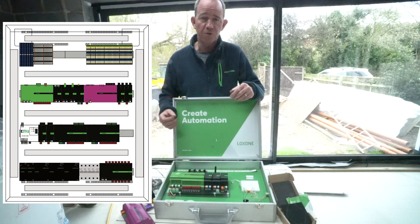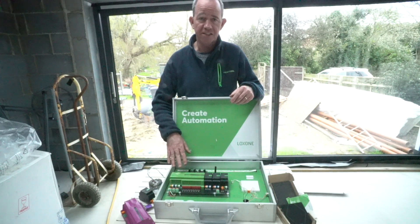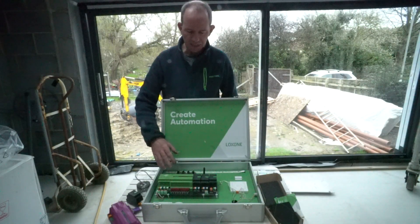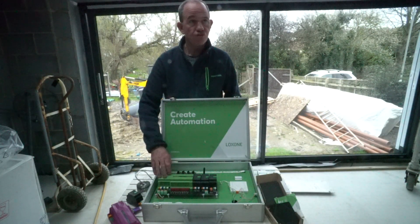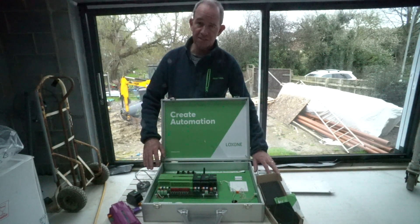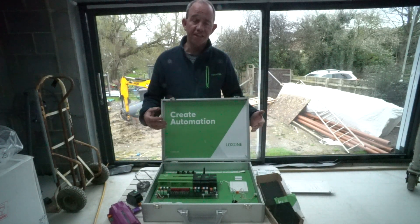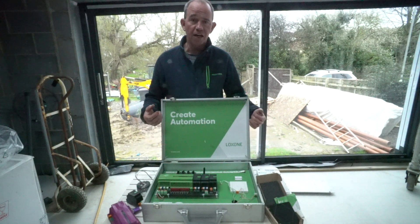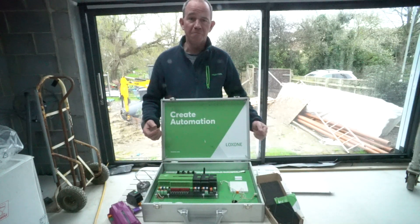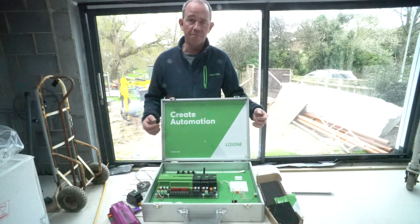I'm really looking forward to getting this set up. What I wanted was a rock solid, ultra reliable system to run lighting but with the ability to hook into other devices. I'll have 10 relays controlling valves for the underfloor heating as well as the Modbus interface to the air source heat pump — all of that needs to be rock solid and reliable. Beyond that, I can see I'll probably end up with Home Assistant as well. I've got Sonos, Somfy, Tahoma, Modbus interfaces, and TCP/IP connectivity through to my GiveEnergy battery and gateway.